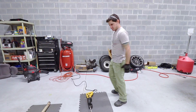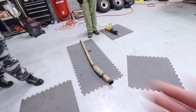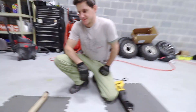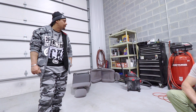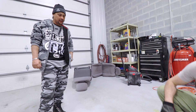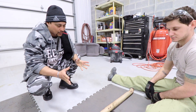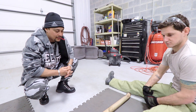Ryan, what are we doing right now? Cutting some pipes so we can practice welding them back together. Yeah, we got some scrap metal — we keep it tossed in the corner over here. We took out one of Andrew's old pipes. The idea is we're cleaning it up — right now just cutting it, and later we'll grab a flapper disc or grinding disc to clean the area where we're going to weld, and then go from there.